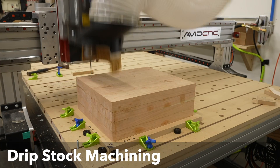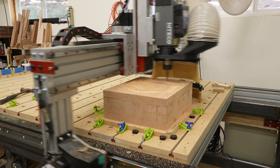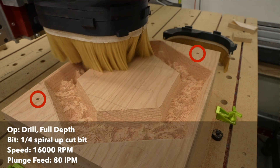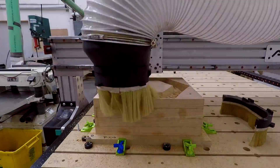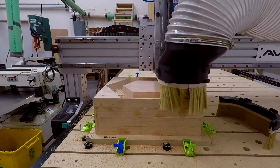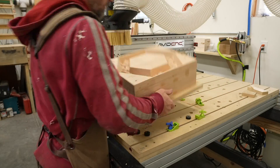My split brush dust shoe design allows me to watch the CNC machine as the process starts and make sure everything's okay — I'll put a link to that video in the description. The first thing I wanted to do was drill some quarter-inch alignment holes. Doing the full-depth holes with an upcut bit helps avoid them being too large. The same upcut bit was then used for roughing. After the roughing was complete, I used a quarter-inch ball nose to do the final pass, which took about an hour and 20 minutes.